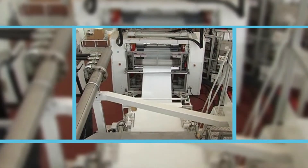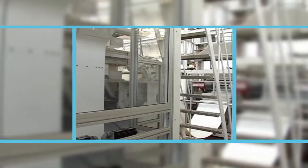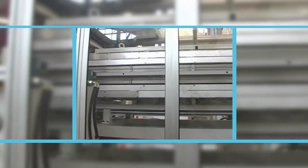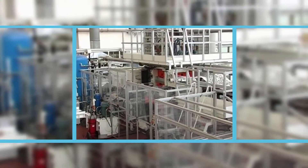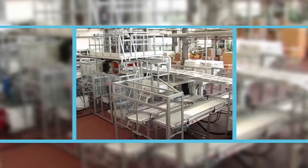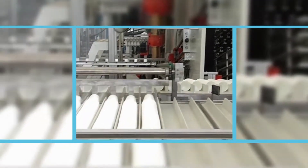The thermoformable sheet range is from 0.2 to 2.8mm. The F87 model features a new unloading and stacking system for multi-row moulds, including a carbon fibre vacuum plate linked to a servo motor and a robotic stacking device.